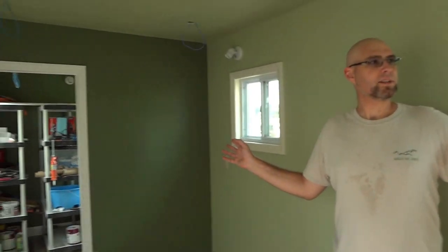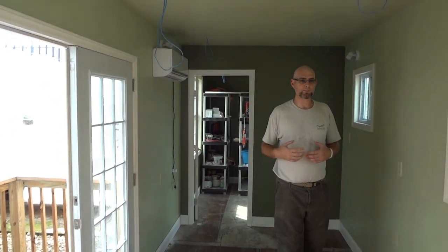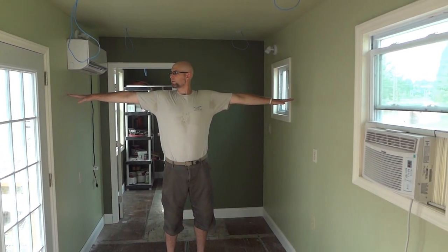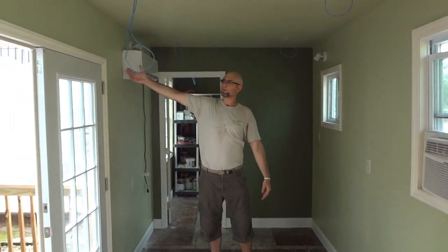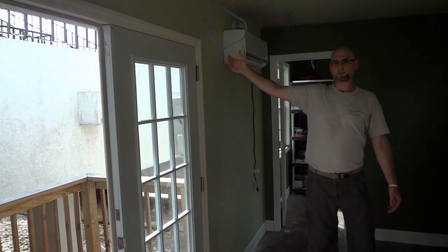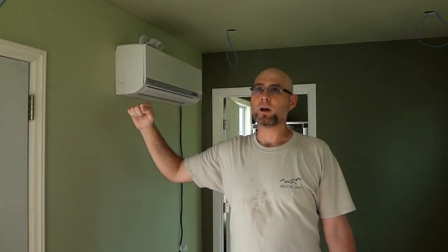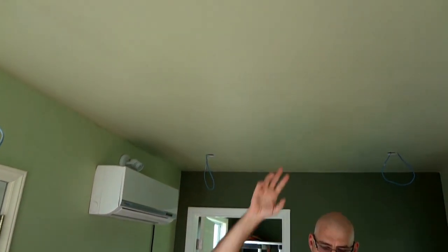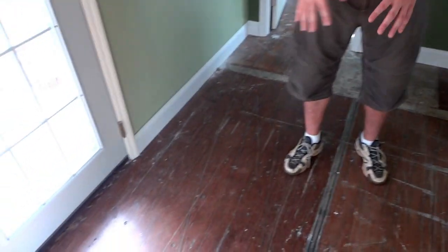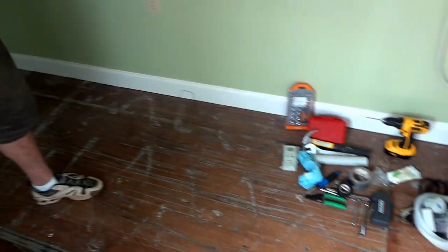We've finished the interior. We have quite a few doors and windows so as to avoid making the space feel cramped. I'm a tall guy, about six foot six, and I can just barely not quite touch the edges. We have metal, blown cellulose insulation, and then sheetrock, designed so that there's no contact between the metal studs and the exterior metal wall to avoid thermal bridging. We hope to blow more insulation in the ceiling and blow some insulating foam from underneath on the bottom. This is the original shipping container floor — heavy-duty marine grade plywood.